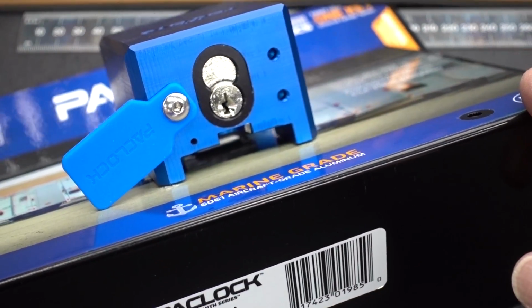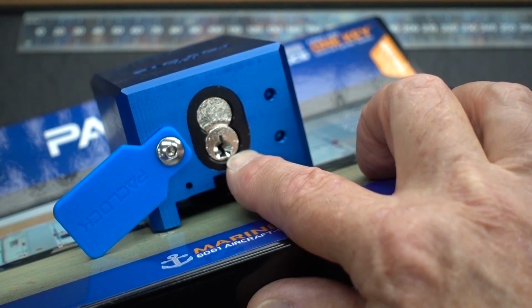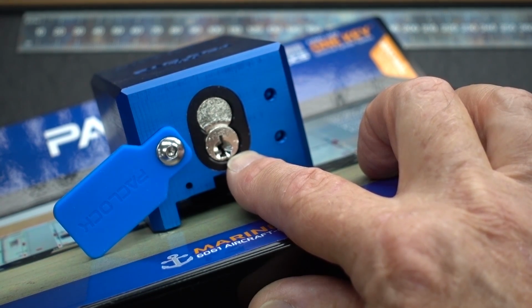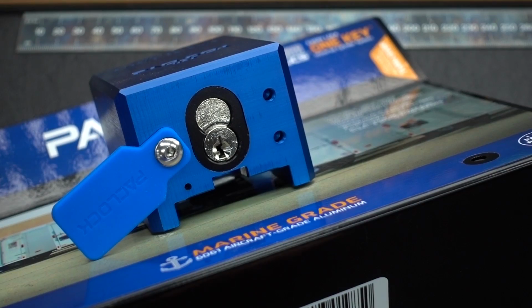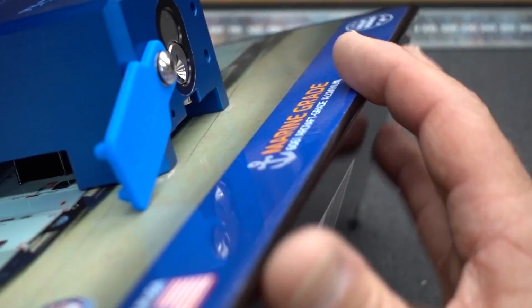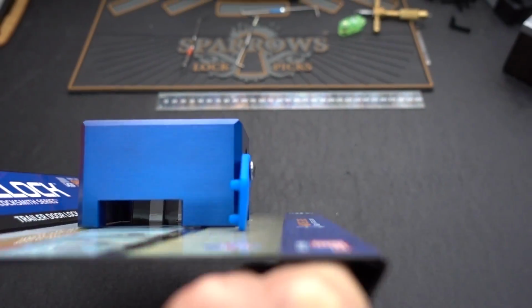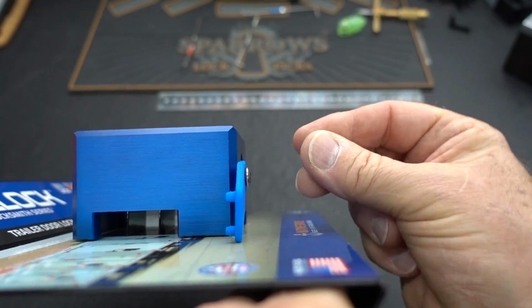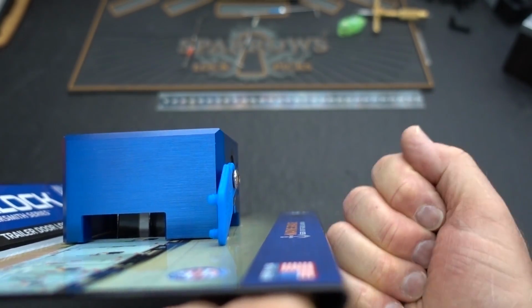The locks are identical to the padlocks. They are replaceable core. These all have 6 pins. They are all security pins, either spools or serrated or a combination of those two. Notice the orientation of this one, and I find that interesting because, remember, this is the door when this is locked in place. And so when it's on the door, you're going to have to try to get in there and pick it. But notice my hand can't go below that door.